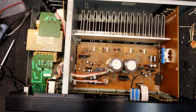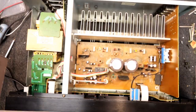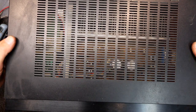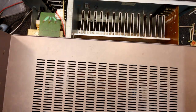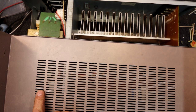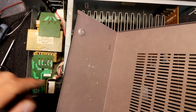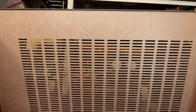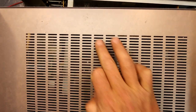The place where the water got in is at the back, through the vent slots — something's been dripping down. You might be able to see something on the inside of the lid here — there's a sort of white ring around this part. On the other side it's quite rusty and has that white stuff underneath, some sort of mineral deposit or coating corrosion. You can definitely see areas where it's been reasonably wet for quite a while — that's not just a one-off spillage.